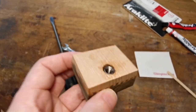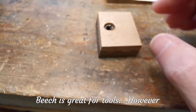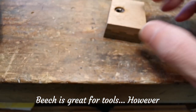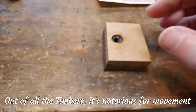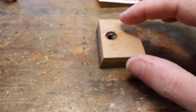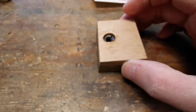That's sufficiently down for me to take some off the surface. The problem with this plane is that this part here is in beech onto the lignum, and the body of the plane is in cherry. The beech moves more than cherry. I want to plane some of this off because I know there's a little hump on there, so we'll plane some of this off later.